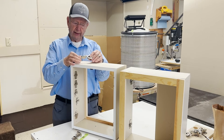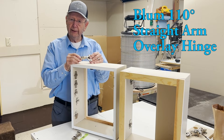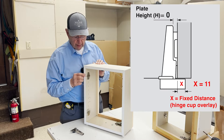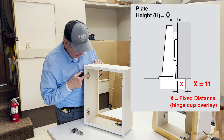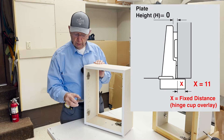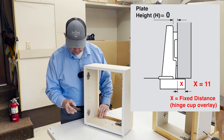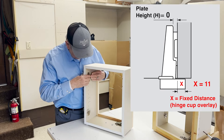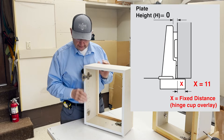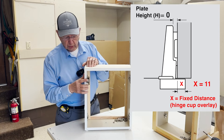So let's get right at it. How versatile is this Blum straight arm hinge, and what can we accomplish with it? First, let's take a look at what we can do with a zero mounting plate, like the one right in here — these are both zero mounting plates. We're going to use it with a straight arm hinge, and then I'm going to clip the hinge on here. This is the straight arm hinge clipped onto the zero plate.